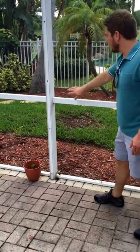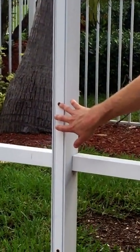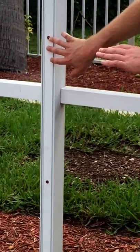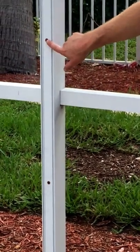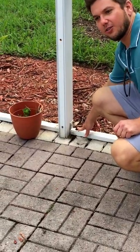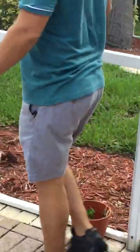I'm sure you also noticed these fasteners are actually the wrong size installed into the face of the beam. This is the part of the structure that holds this sucker up, and here we've used a size of screw that's two sizes too small. In addition, you can see that all of our fasteners are rusted — so both on our beam and our connection to ground, we have fasteners that at this point have failed.